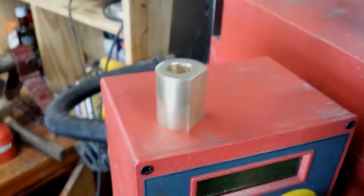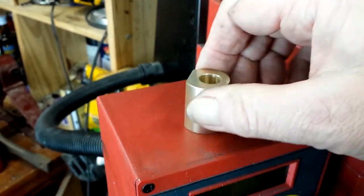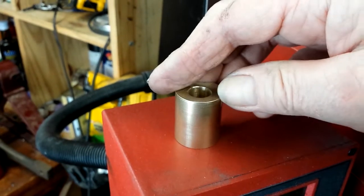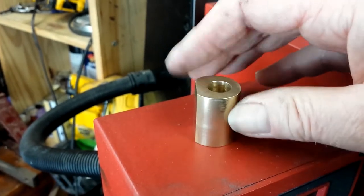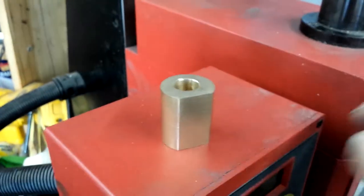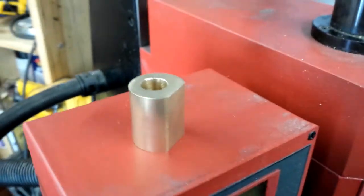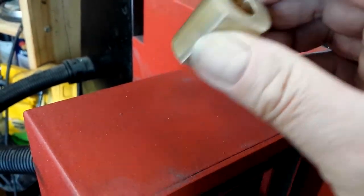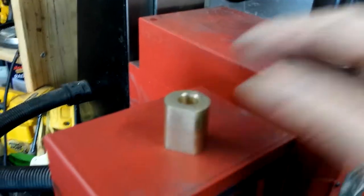Here's the main form of the cylinder drilled and reamed. The bore still has to be polished and the outside will need a polish too as there are a few marks on it. The face is not too bad but still needs various holes drilled. I'm going to wait until I've got my DRO completely set up — waiting for parts to finish that job — before drilling the remaining holes.